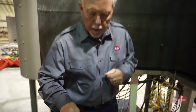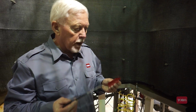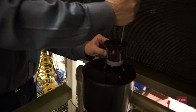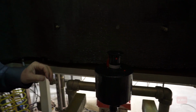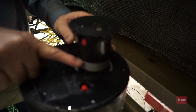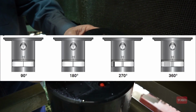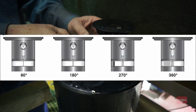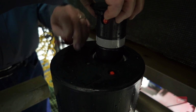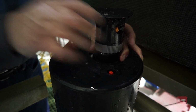So with that, the sprinkler would be in its normal retracted position, ready to be adjusted. With the Toro sprinklers, I can walk up with my riser pull-up tool and the hold-up feature, pull up the riser, install the hold-up tool into its proper position, and then if we look closely, we can see that the arc adjustment band, the gray adjustment band, has indicators, and there's a small arrowhead on the back of the nozzle base aligned with the back nozzle so that I can quickly tell what the arc is currently set to on the sprinkler. So I already know at a glance that this sprinkler is set at about 90 degrees. There's my left arc position, and there's my right arc position.